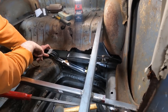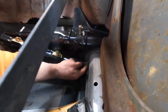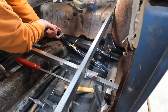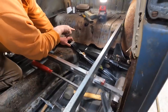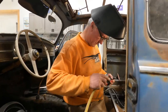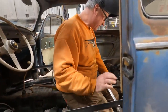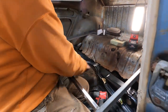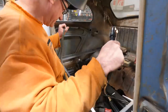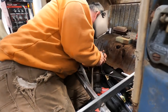So we got the passenger crossmember in. We got to bolt it - everything lines up, bolt down through the torsion tube lines up, perfect. We're just gonna weld our spot welds in here to tie in the heater channel with the crossmember, and up here we'll spot weld these two to connect both crossmembers together. Grounds are very important - I failed at the first weld. You're totally cheating, you're getting a better ground than I had. Well, that's all part of getting a better weld. That's Larry approved - might not be Jason approved.